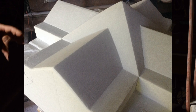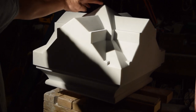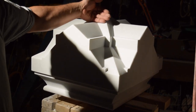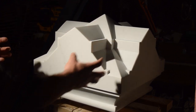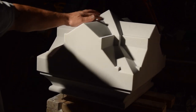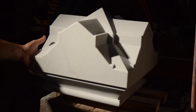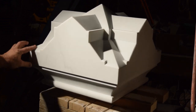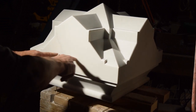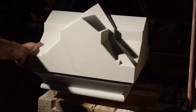And then after everything's put together and everything's good, it's all a little puffier or round because you've got some crown in it, then you start lowering all your surfaces to get everything as flat as possible, because this has to be straight, this has to be straight, this has to be flat between them, and it also has to work with the other adjacent sides. So all of these things are done at the end, sort of together, because we have to settle these planes, get this flat, get this straight. Same thing with here, and the corners have to both agree with the corner, so the corners match, and they also have to agree with their complement on the other side, so that this is a straight line and these look even. And so you have to just sort of work with it and put it together.